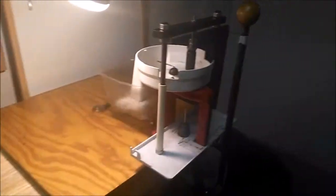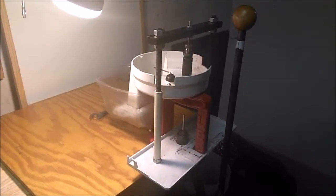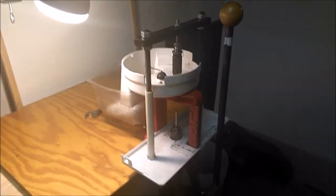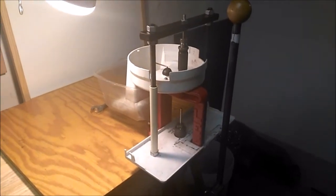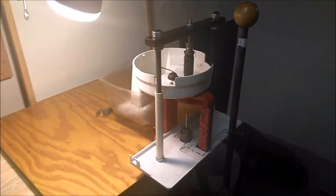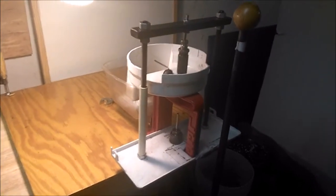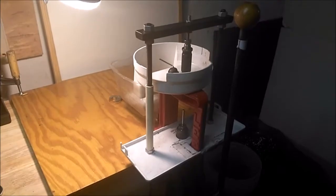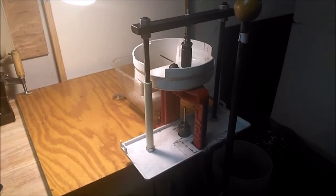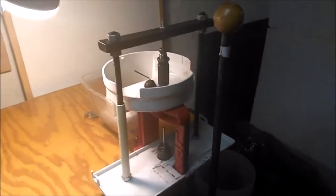But yeah, that was part of it, not having to harden, because really the main suggestion is dead soft lead. It says up to 10 BHN, but admits that's an arbitrary number. Good question. With my longer cores, too hard makes it really tough, because it's hard to get a good angle. Plus, there's all that extra pushing to do. But the shorter ones where you're just taking off a few, like 5 grain or whatever, probably you could get away with a few more BHN.